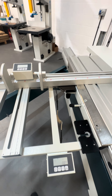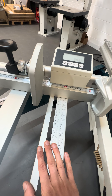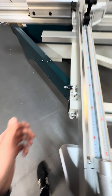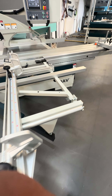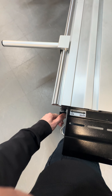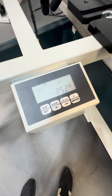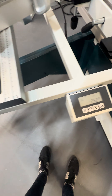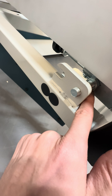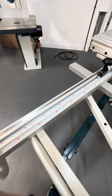For the digital readout angle adjustment, you've got three handles to loosen: one at the start of the crosscut fence here — make sure that's nice and loose — next one's underneath the mitre guide, make sure that's nice and loose as well, and then there's a lever on this side. Loosen that enough to flick it out, and with the sliding table locked it'll be easier. You can pull the crosscut fence around — it goes all the way to 49 degrees. Pull it to 25 and then bring it back in so that the metal block is touching the head, and that is pretty much where zero degrees will be. Then lock it off — simple as that, back in square.